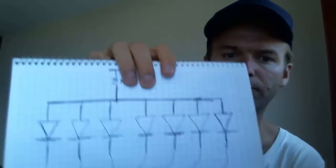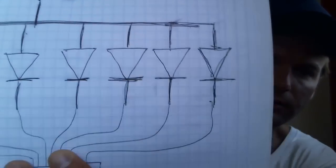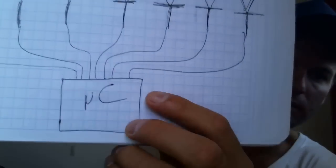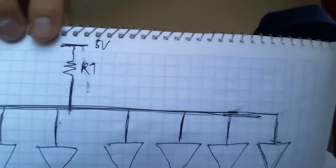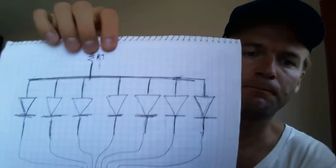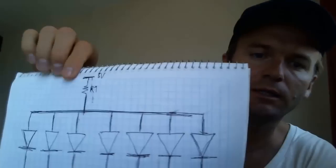Here is the complete schematic. We have 5V here, a resistor, and we have the LEDs in the seven-segment display, all connected to the microcontroller down here. To choose the right resistor value, I'm going to calculate how much current I need for one LED, because I'm thinking I'll only have one LED on at a time, then switch them really fast so it looks like all the LEDs are lit simultaneously.